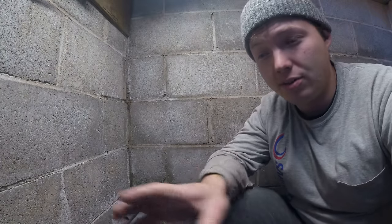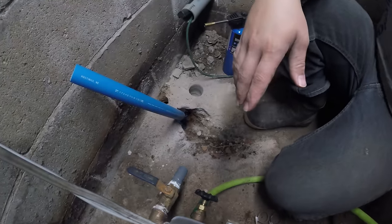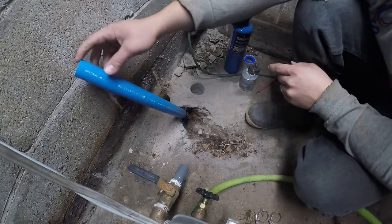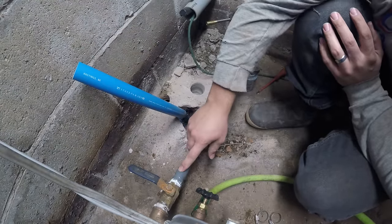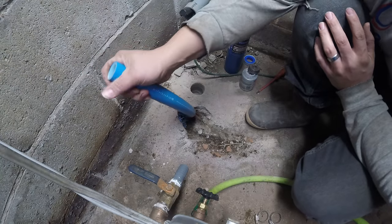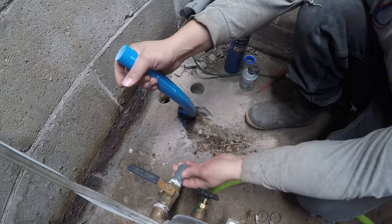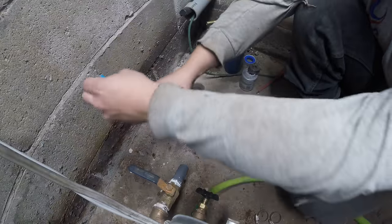Hey, my name is Ben. Thanks for stopping by. I am currently in my well house and we are going to hook up this water line right down here. What we need is a one inch water line that we're connecting to this barb fitting right here. That's what I specifically want to talk about: just the process of getting these things to push over these barb fittings, because it can be really a big challenge because of how stiff this pipe is.